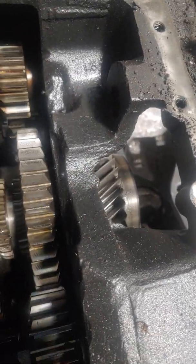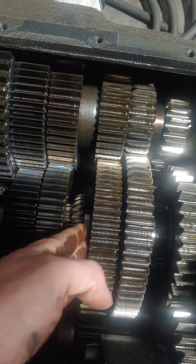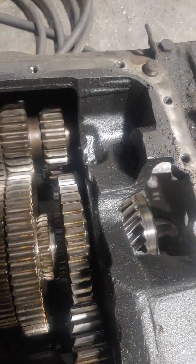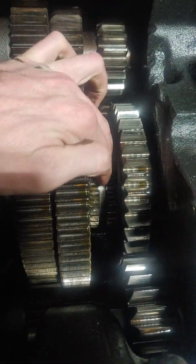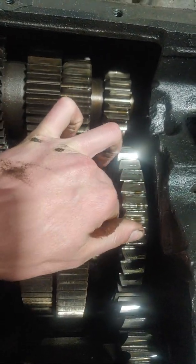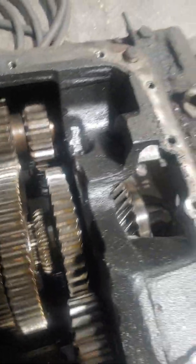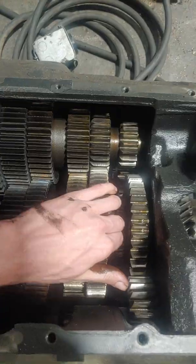All these gears rotate while the clutches are released and the engine is turning. Now when I rotate the input shaft up front, all of these gears turn until you lock one in. When I engage this side clutch and push it into that gear, the back gear stays with me at a set speed. I can then disengage and engage the reverse gear — you can see it rotate in the opposite direction, with the reverse idlers now transmitting power. That's the front box; it's pretty simple.